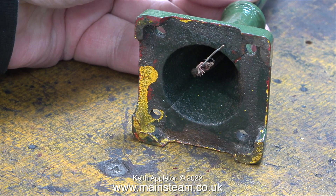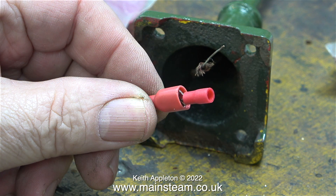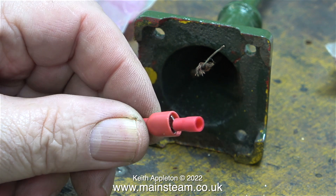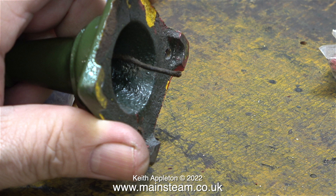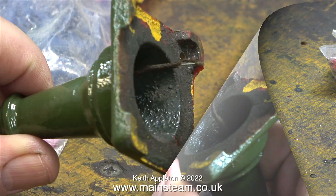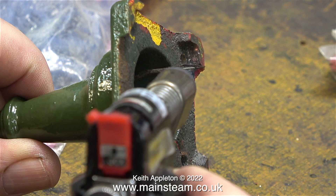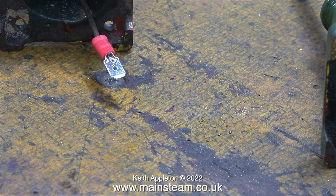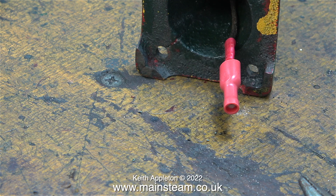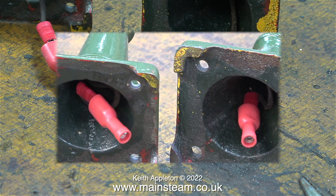The first job is to shorten the cable slightly; I want to start off with a nice piece of clean copper wire. In England these are called spade connectors — they may be called something else in other parts of the world — and I'm going to use these underneath the lamps for the positive connections, although for this application the polarity is unimportant. I cut the wire cleanly and stripped off some insulation. The insulation didn't strip off very cleanly, so here's a good idea when dealing with old cable: use a small blowtorch to burn off the insulation. The next part is to crimp a connector onto the wire. I repeated the process for the other lamp and ended up with two lamps with connectors on each of them. Once all the connectors are fitted and wired they will push up inside the base with no stress on this very old cable at all.